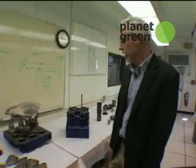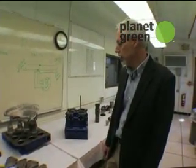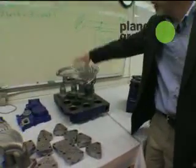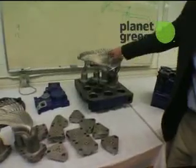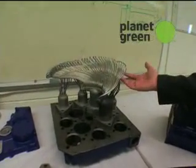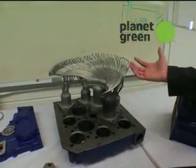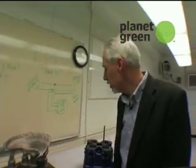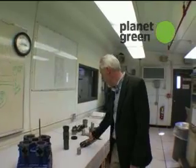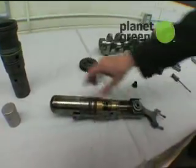We're looking at the insides of a Stirling engine. Starting with the heater heads, where all that intense solar energy is collected — we have tubes here with hydrogen flowing on the inside. When you heat a gas, it expands; when you cool it, it contracts. We use that expansion and contraction to drive a piston. There isn't anything really special or exotic here, and that's what allows us to have a highly efficient system but also achieve ultra-low cost.